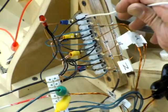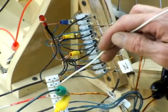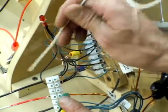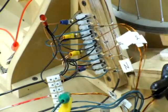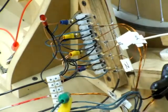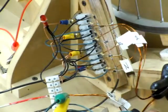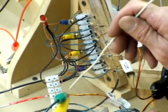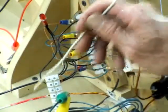You can see these black wires, which connect to the emitter, all come together. This is the negative wire that goes off to your run batteries. Now down here, these are all the beginnings of the coil and they all go to the power — twist them all together and connect directly to the positive of the run battery. That's this white wire here with the red color.